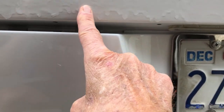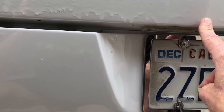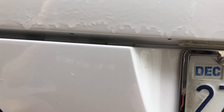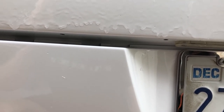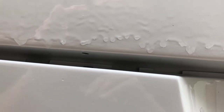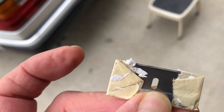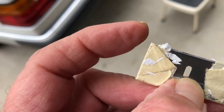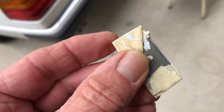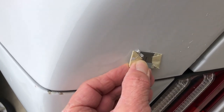Just go along and cut them down. Then I'm gonna sand it with some 400 and graduate all the way down to 2500, then polish it out. I put masking tape at either end so the sharp edges don't dig in — it gives a little buffer so you don't go all the way through.